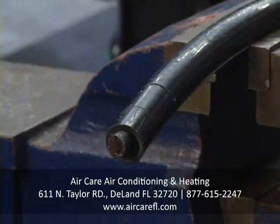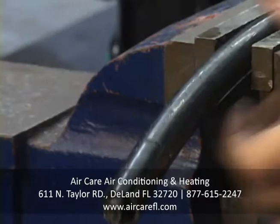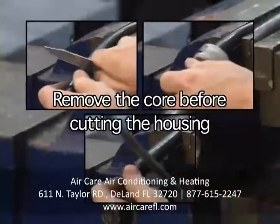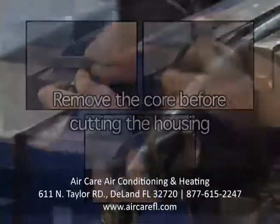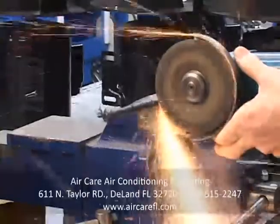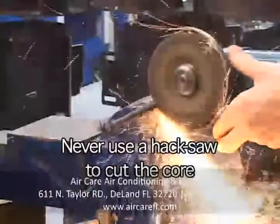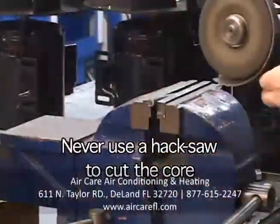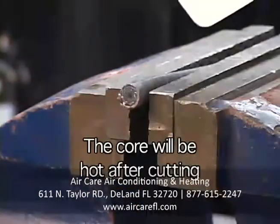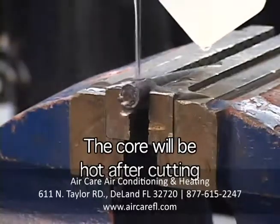The outer jacket should be about 2 inches shorter than the core to provide proper clearance for the core. The jacket can be cut with a knife, a tubing cutter, or even a hacksaw. The cable core, however, must be cut with a cutoff saw or grinder. Do not use a hacksaw or other type of saw because they will not make a clean cut and will tend to separate the wires in the cable's core. Caution! The core will be hot for some time after cutting, so don't touch it.